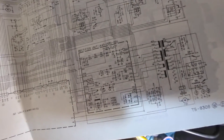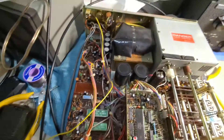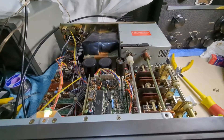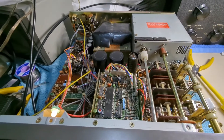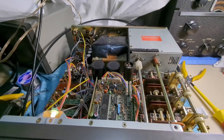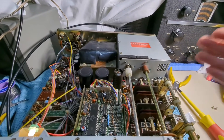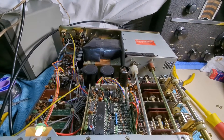To cut a long story short, these screen lines are critical to the operation of the screen regulation as well as the driver tube, and when you start getting issues in this area it won't be long before you see issues in the entire radio. When I saw that the issue would occur as things were heating up, I thought maybe it could be the final tubes, so I disengaged the screen voltage on those so they wouldn't be warming up. The issue continued.